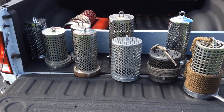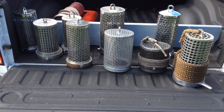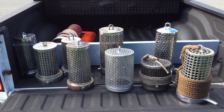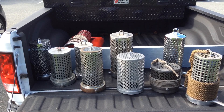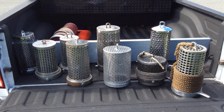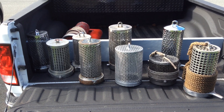We'll take a look at all this when we do our performance testing in late September — the 30th is the designated date right now. This is just a good overview of looking at strainers. A lot of times people buy a barrel strainer based upon what will fit in a compartment, or they buy it from somebody else without having used it in their pump test. A general good rule to follow is that the barrel strainer that came with your pumper — as part of the NFPA minimum equipment requirements — should be able to produce your rated capacity when you do your acceptance test for your pumper.